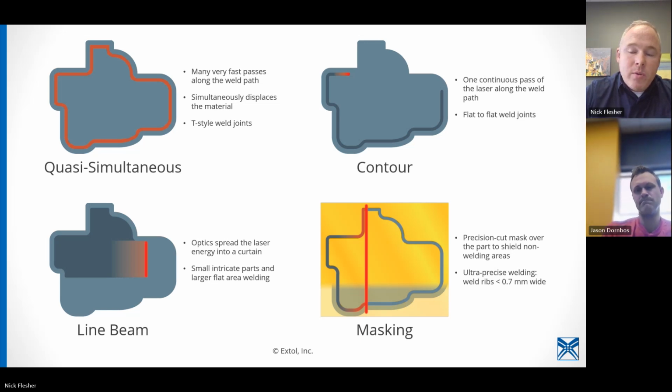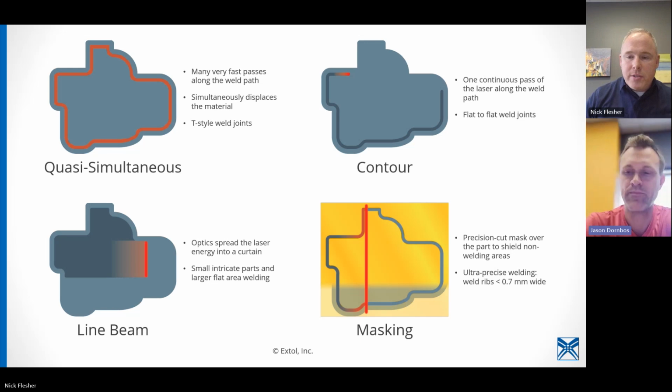Colorants, white is typically challenging. You can design different colors that are IR transmissive, and you have to have good absorptive content. So we typically see carbon black in the absorptive content. So the answer to the question is yes. To get into the specifics of how, I think it probably makes sense to continue the conversation.